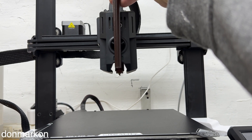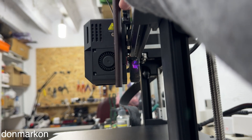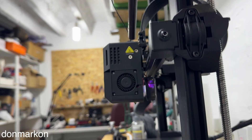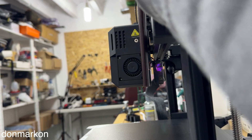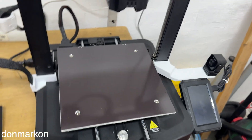With a pen, you want to check if the nozzle is straight. From this side it looks quite good, and from this side it is also good. You also want to see if the print head is parallel with the rail. In my case it is, at least as far as you can see, well adjusted.